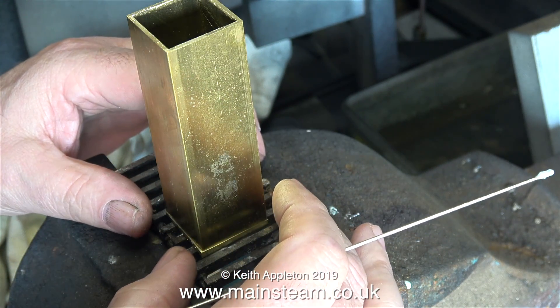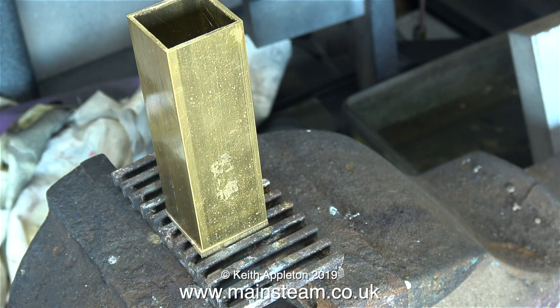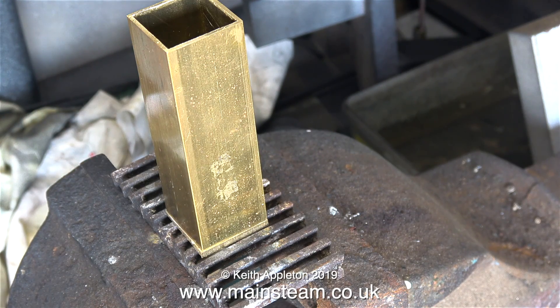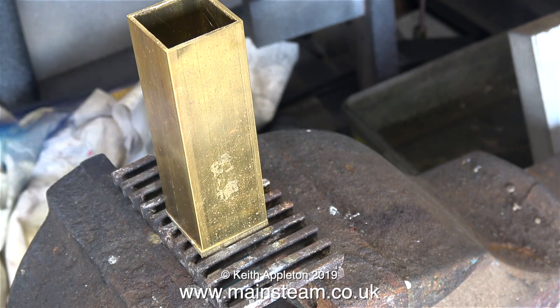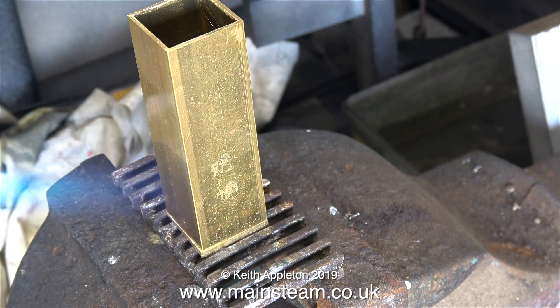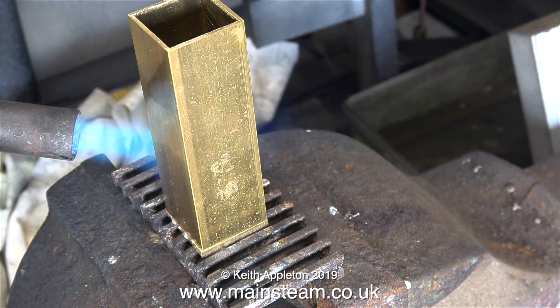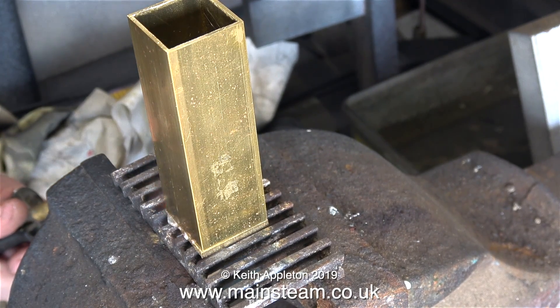What I'm going to do in this clip is do it wrong - I'm going to use a blowtorch nozzle that is too small to get this part to the correct heat, so you'll see what happens. This is the nozzle that I would normally use for silver soldering copper piping, and although it melts the flux and the silver solder wire, it's not really making much of an impression on the main part of the brass. I'll try it from underneath.